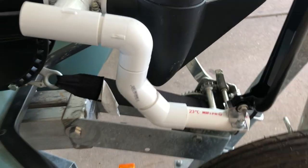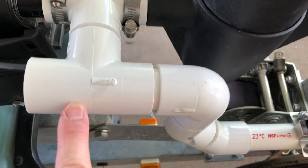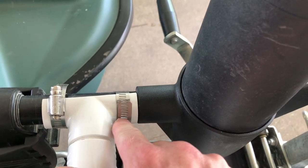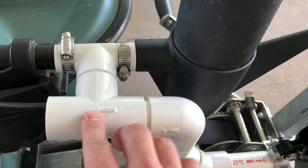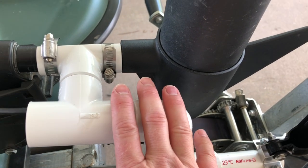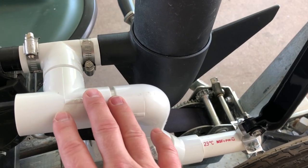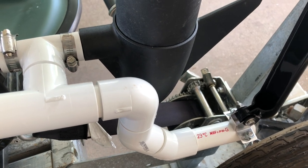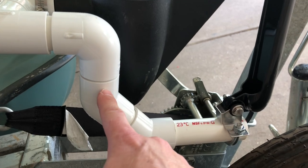I made a PVC bracket — this is all one-inch PVC. I took a T-section, cut it in half, and used these metal clamps to secure it to the trolling motor shaft. From there I cut two-inch pieces of one-inch PVC and pushed them in. I didn't use any PVC glue for any of this and you don't want to, so you can still take it apart. When you hammer it all in place it holds up very well. I got two T-intersections, cut one in half, and then there's a 90-degree fitting.